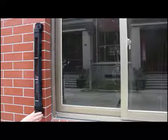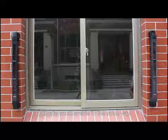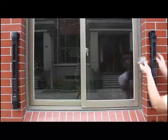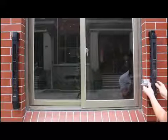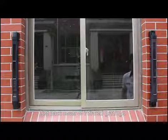Set the back cover of the infrared grating back in place. Calibrate the other side in the same way. After calibration, adjust and fasten the screw. Then retest the gratings and make sure they cannot be moved. Set the back cover of the infrared gratings.